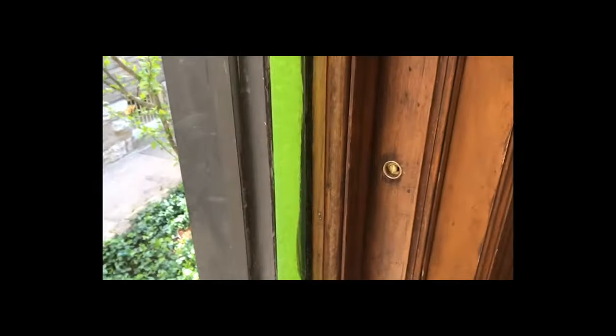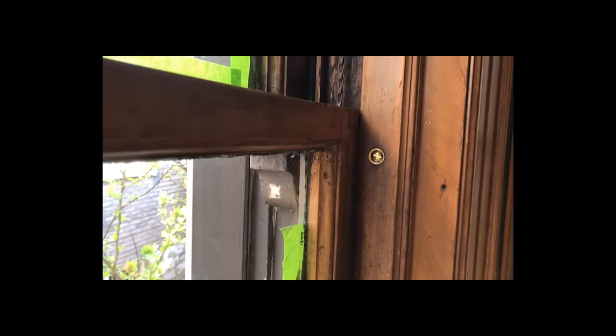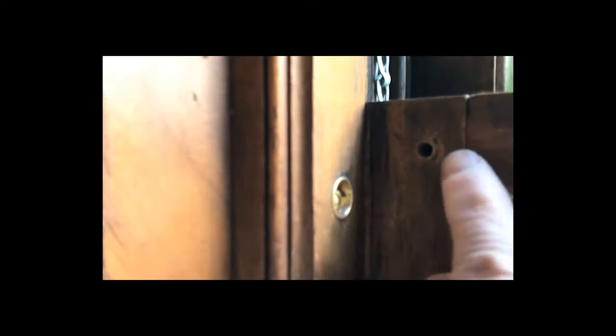Here we have brand new brass screws with a little grommet or ferrule, adjusted so it's up against this. We can see they drilled a hole. What they did is they drilled a hole and then put a 16-penny nail through it whenever this thing stopped working very well.